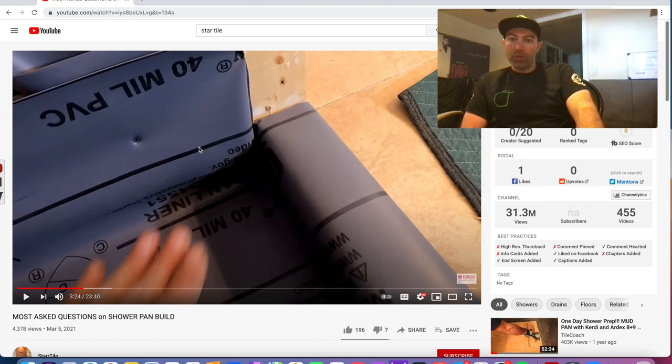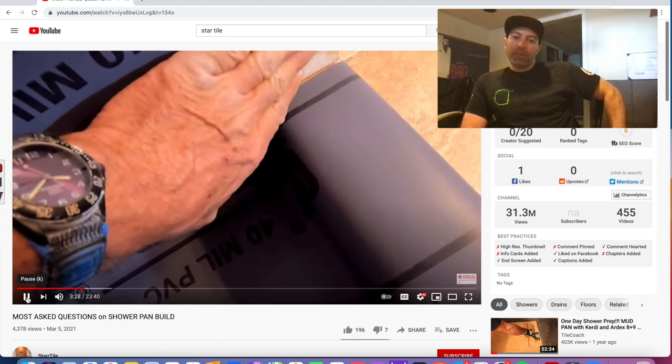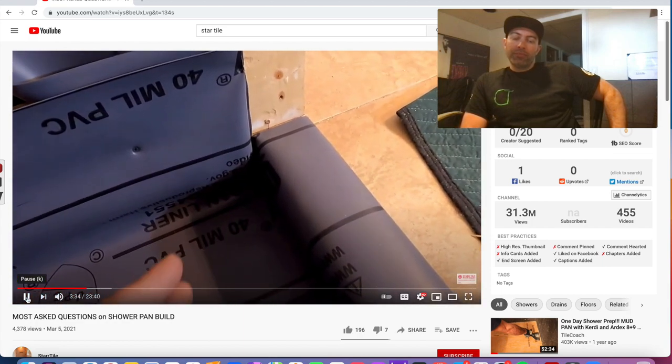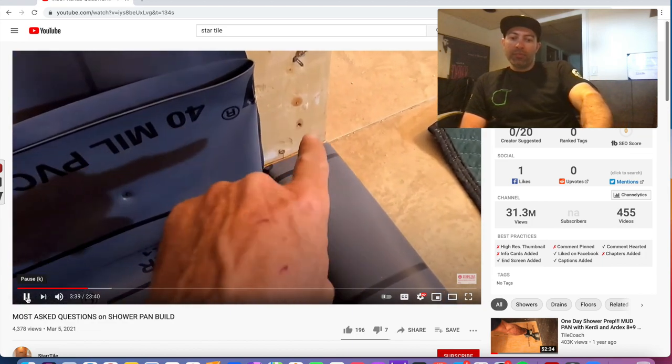As long as they're corrosion resistant. That's important. The wallboard, as I said, is going to overlap all of this. The wallboard is going to get waterproofed. The curb is going to get waterproofed. Everything is going to be waterproofed prior to. So in the old days, before we waterproofed everything, yes, that's something to look at.